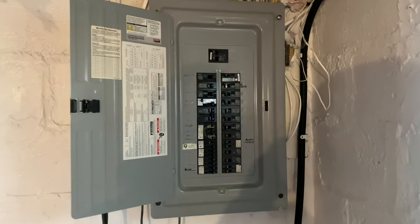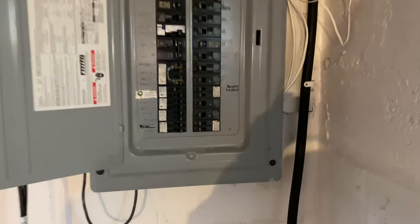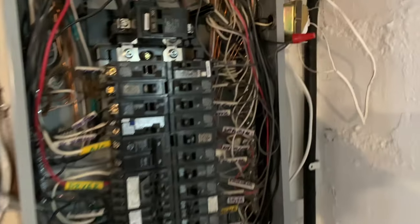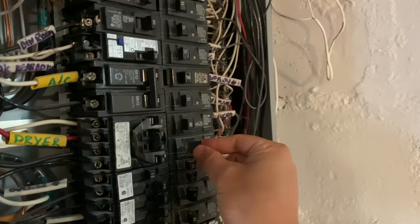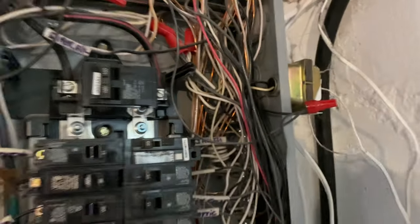This is the transformer I'll be replacing — it's in the electrical box. The first step is I'm going to have to shut off the breaker that goes to the doorbell, but I have no clue which one. So I'm going to take off the four screws and try to locate the wire going to the transformer. Now I have all the circuits exposed. The transformer is connected to this wire nut that has one of the main black wires — it's going to this 15 amp breaker, which shuts off the basement lights.